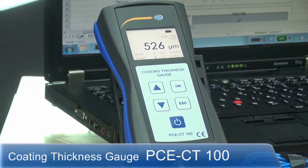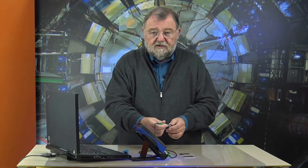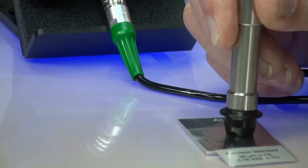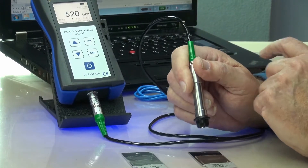A high professional measuring device to measure coating thickness from PCE: the CTE 100. I have it here on my table. It is delivered without sensors, because there are so many different sensors for so many different usages. They differentiate themselves depending on if you want to go around corners — angle sensors or anything else — as well as the resolution of the area you want to measure. The sensor here is an FN 1.5 and is simply connected at the bottom. Then I can freely go everywhere I want to measure, like here on my probe drill — it is aluminium. When I go onto the iron part, it also reads that.